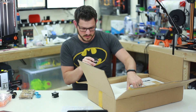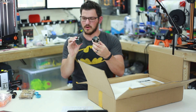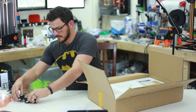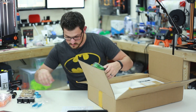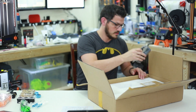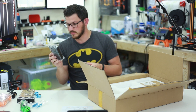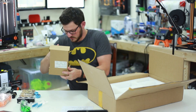We've got three motors in here. These are smaller — I guess they're just small NEMA 17 motors, all Elksmaker branded. We have some type of carriage, laser glasses for protective eyewear — make sure you wear those. We have a power supply that goes 110 to 240 volts, one amp, 50-60 hertz, 12 volts output at 5 amps. And here we have what's probably the laser, plus all the electronics.